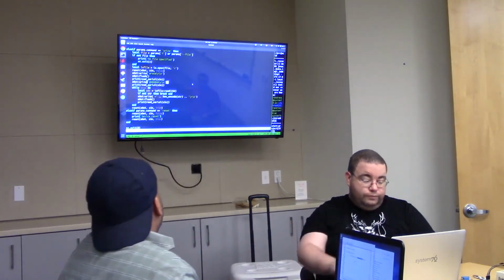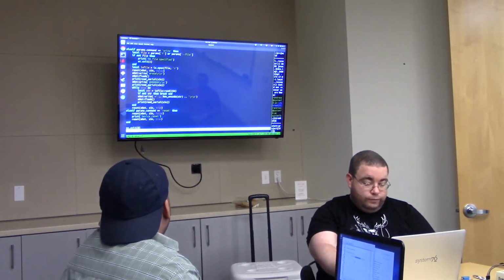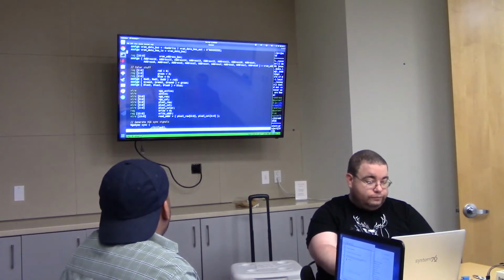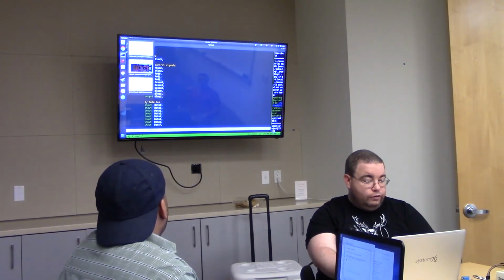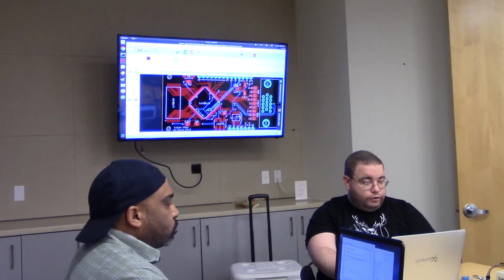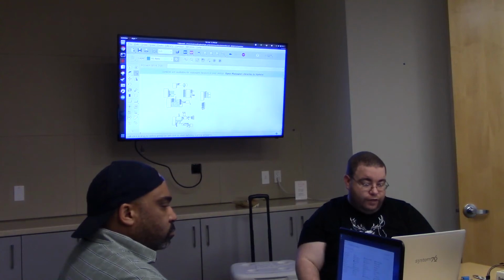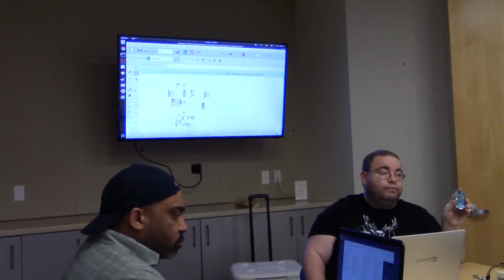So what I've been doing, the eventual goal here is for this thing to be a video output device for a computer. So let me actually put up the schematic. What I did here is I made the same circuit, minus all the stuff that's not video, and then I added in this 1 megabit RAM chip.